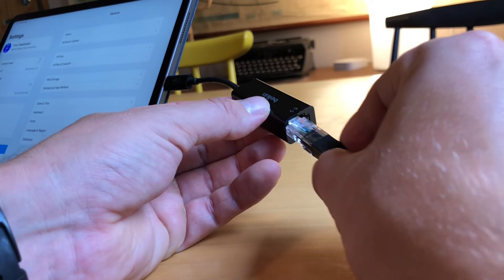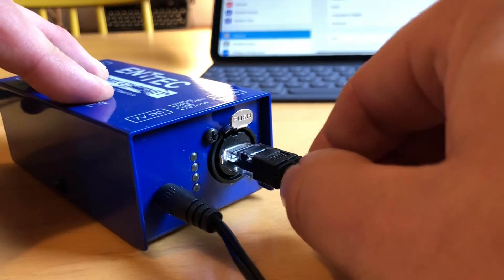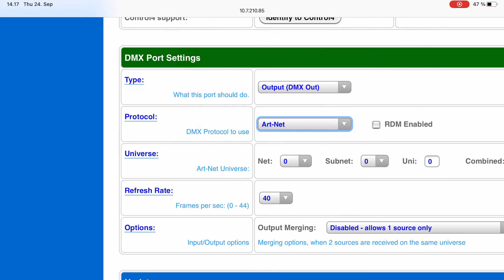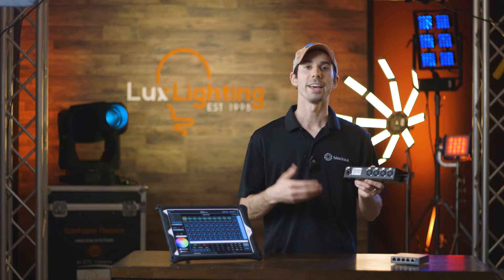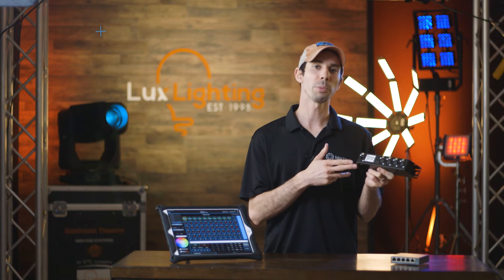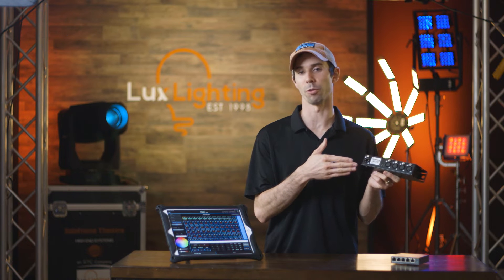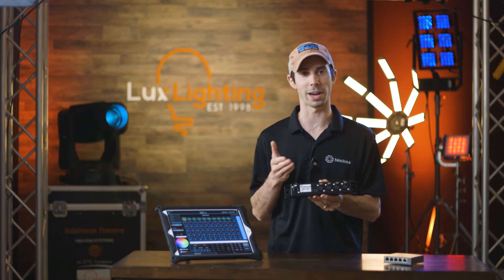Once you've plugged in your adapter to your iPad, you can connect any Artnet or SACN node through Ethernet and there are a ton of options out there. Here we have the Entech ODE — you input SACN or Artnet data via Ethernet and through their software you can configure the DMX output to whatever universe you want. Here I have the eDMX4 Pro by DMXKing, which is one of the cheapest 4-port gateways on the market. It has a PoE port, which means not only do you send it data over Ethernet, you also have to send it power over Ethernet. You cannot connect your iPad directly to a PoE gateway because it doesn't provide power.